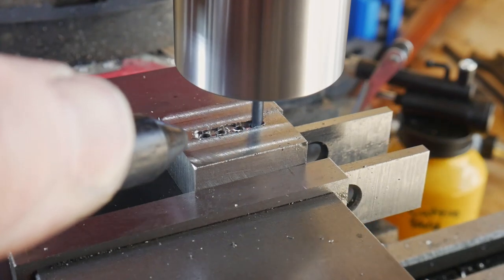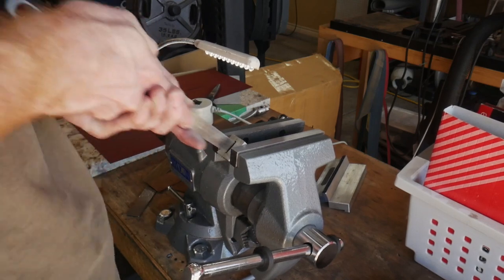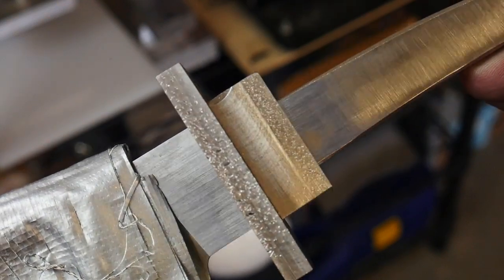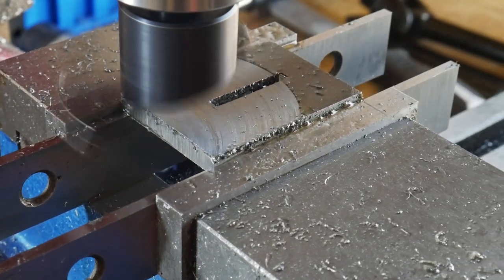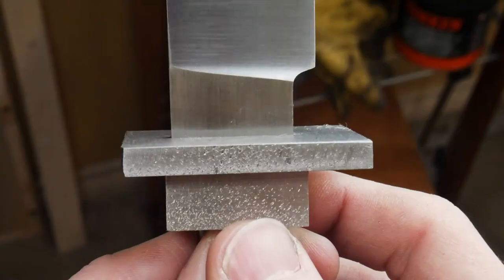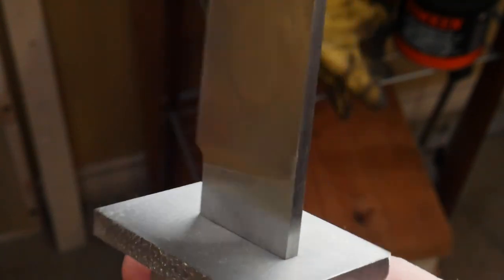I then milled out the eighth inch side with my eighth inch carbide end mill. Using the modified files from the guard work, I squared up the top and bottom of the slot so the spacer will slide up onto the tang. I also wanted a better surface finish on the faces of my guard, so I whipped out my fly cutter to achieve this. I noticed that hammering the guard onto the tang created small indents at the top and bottom of the guard material, so I removed a little material in those areas to create a slight ramp from the guard material to the shoulder. Overall I was pretty happy with how the fit turned out.